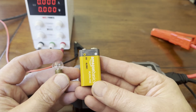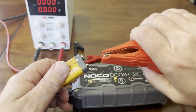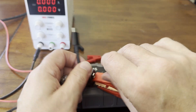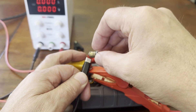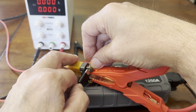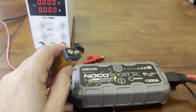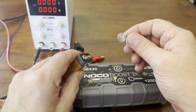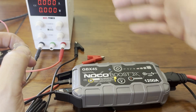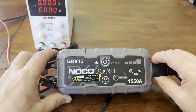If you're going to try the battery, leave a comment down below and let me know how it works. The basic premise would be: grab the positive side of the nine volt and hook it to the positive side here, then take your USB which is the negative, connect one side of the bulb to the battery, then connect here, and the bulb will limit the current so you don't put too much through the unit. Just make sure you use a small bulb — nothing more than four or five watts — to limit the current. Leave it on the charger until the actual charger starts working, and then you're good. Please like and subscribe — take care, have a good day.